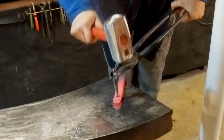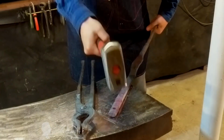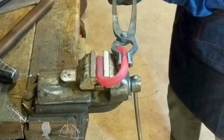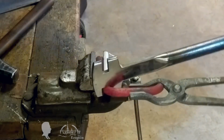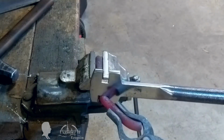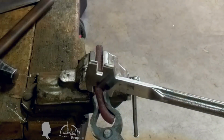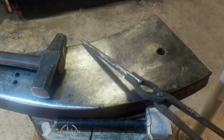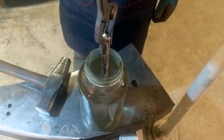Remember, earlier in the video I said that my Cloggers knife will have two alternative mounting options. This means that the knife must be equipped with a pivoting hole. I decided to use a drift to punch it, as the hole's diameter will be larger than the width of the strip itself. Additionally, I had to make a special cylindrical drift to be able to enlarge the hole to the desired diameter.